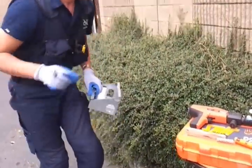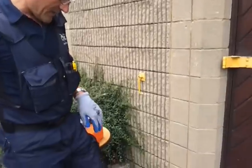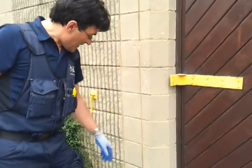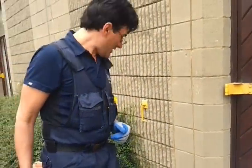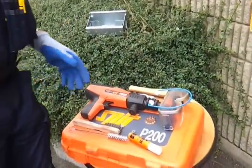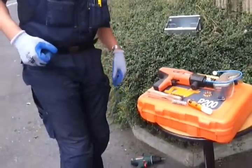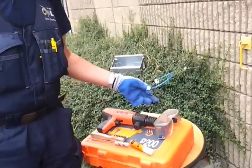Now, when we move onto concrete walls or floors, like these concrete blocks, or mortar between bricks, you need to use some kind of masonry nails. So traditionally, we were using these nail guns, so there is Spit, there is Hilti, or also some high impact drill, not like this one. All of that costs over 500 euro, but as well as that, you need to have always with you your goggles, earplugs.